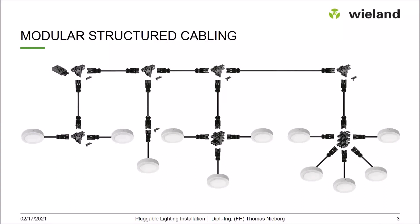We always try to combine standard solutions with distribution blocks, available in different types. You can have a one-to-one connection with a locking to connect a single luminaire. If you have two luminaires, you work with a T-piece — one input and two outputs. For three luminaires, you use an H distribution block, with one input and three outputs, shaped like an H.